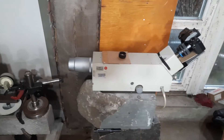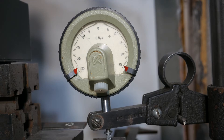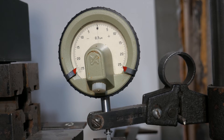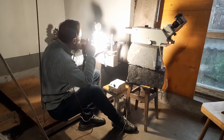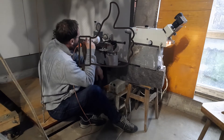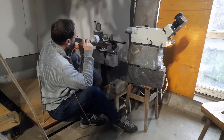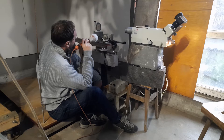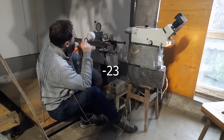By watching this video, you can form an understanding of the accuracy of this instrument and its limits, including what these limits are constrained by. I simplified the design of the stand by accurately adjusting the comparator simply by turning it in a loose mount and applying some force up or down. I turned on the camera and step by step raised the straight edge by 1 micron, giving the mirror time to settle from vibrations caused by my hand movements. This process takes about 5 seconds. For this experiment, I used a comparator with a resolution of 0.5 micron, which allows me to quite accurately control the movement of the right edge. The expected error in this movement is plus or minus a tenth of a micron, which is entirely acceptable.